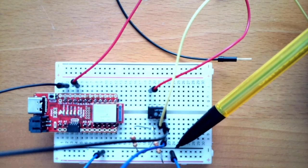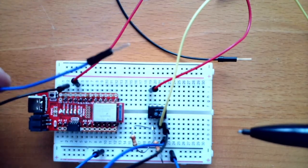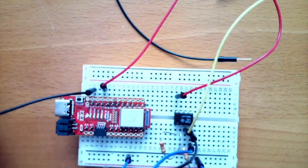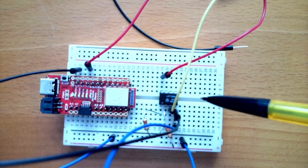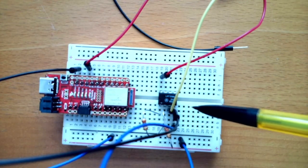And then this other blue wire here to the side, this one, if you get it in the camera's view, that's going to be the ground for the incoming signal from the function generator and also for the oscilloscope. The oscilloscope and the function generator both need to agree on ground, so you've got to connect them both to the same ground, and it has to be the same as the ground for the amplifier and for the nano.